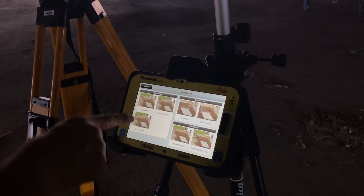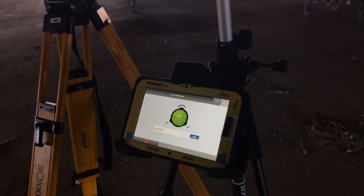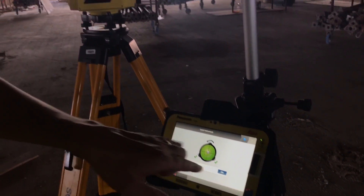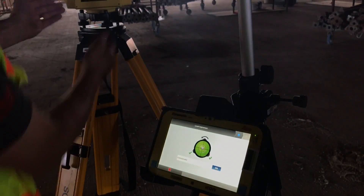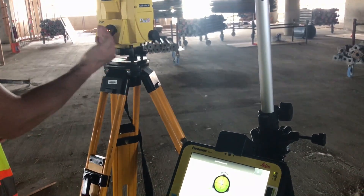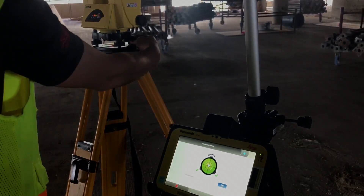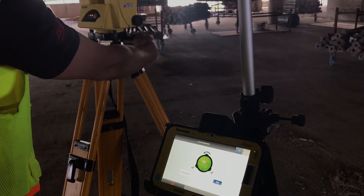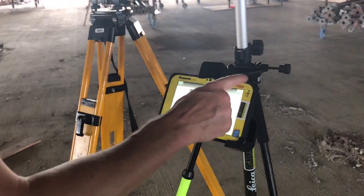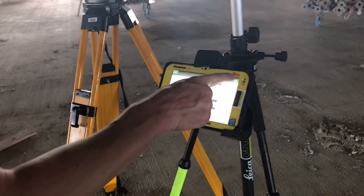We're always going to go right here to our setup. We're always going to select anywhere, and then we're going to level up our total station. When we go to level up, we want to match these two screws to this base, so we're going to rotate it like so. Now you've got two screws that are flush or parallel with this. We grab that back button, slide it in, all the check marks come on, and then we can advance to the next.